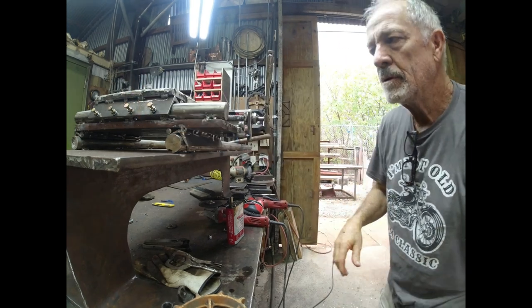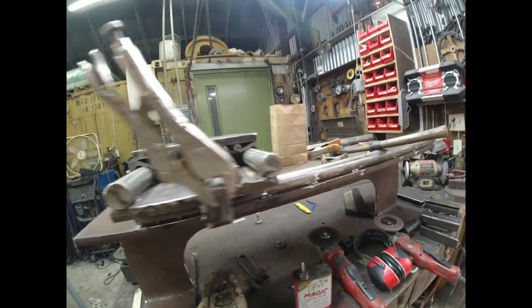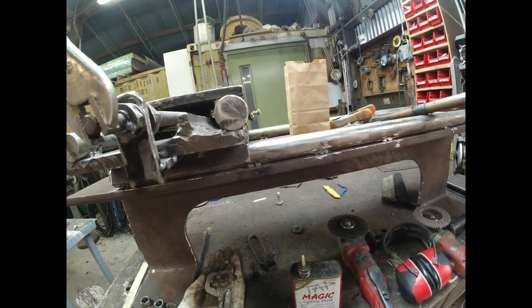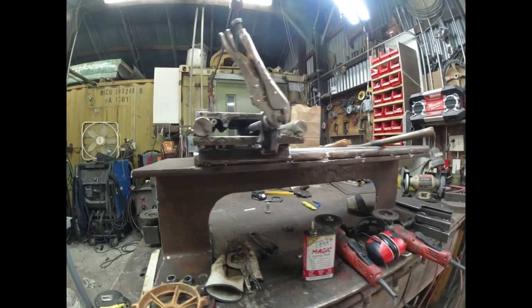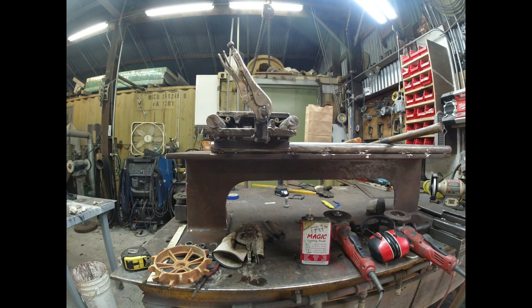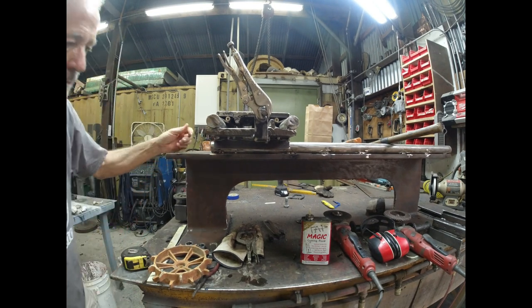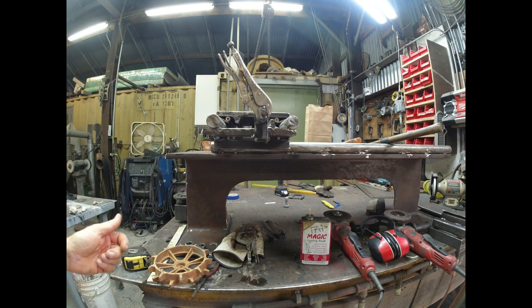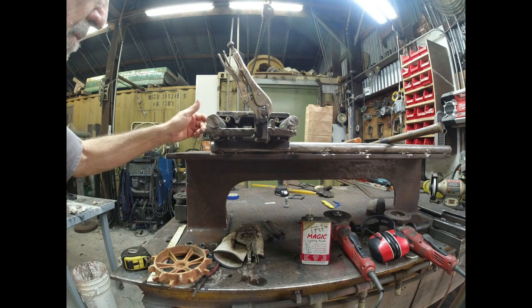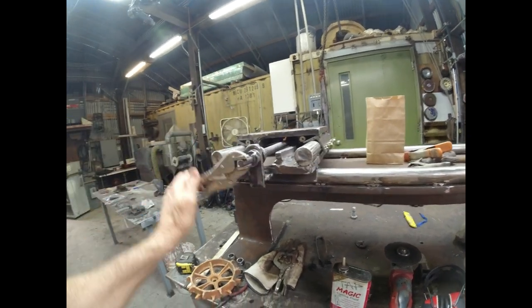And then I put these set screws, 4 on each side, and they go under the center point of the round bar, so they keep the carriage from lifting up. And they work well. I know they'll wear, but one, I'm freaking 70 years old, so nothing will wear out in my lifetime. And two, they're adjustable, so we can keep tightening them up. So I'm pretty happy with this so far.